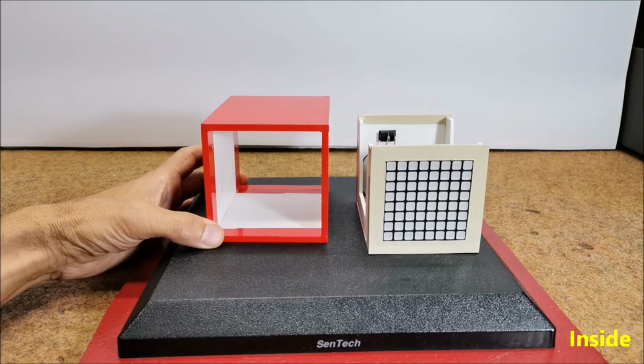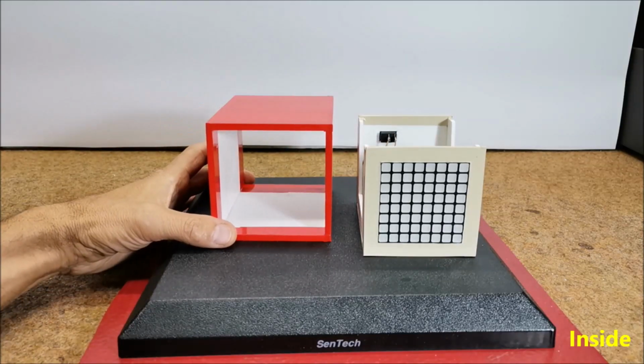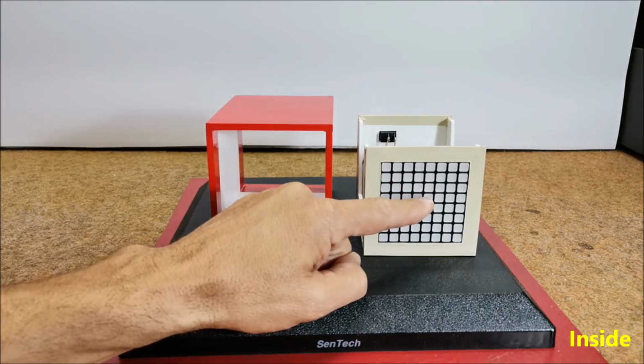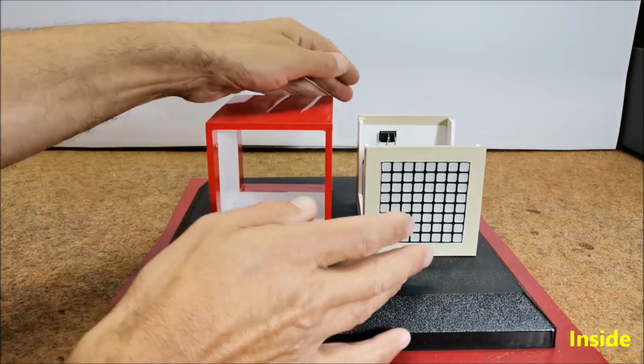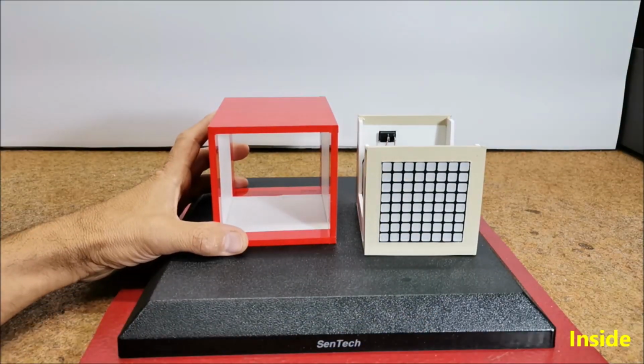Otherwise, in the pins tab, a connecting diagram is presented, which contains a small error in the markings of the cathodes and anodes of the diodes in the matrix. In any case, I recommend that you use the schematic diagrams that I have presented below: one is if you use a ready-made 8x8 matrix with common anode, like in my case, and the other is with a do-it-yourself matrix.